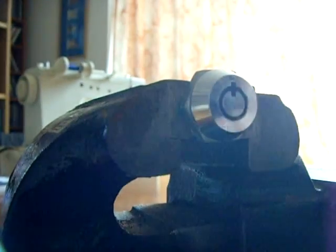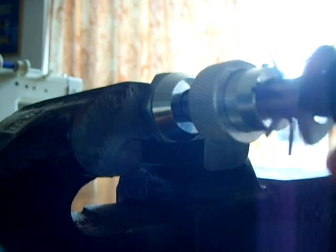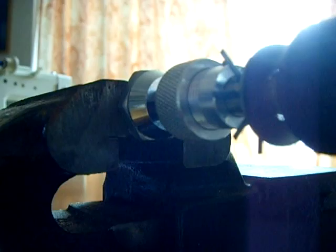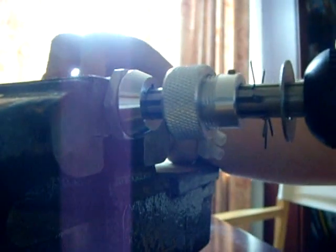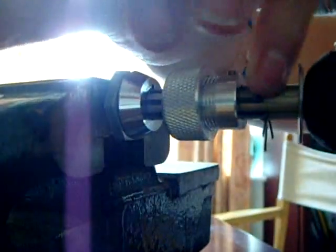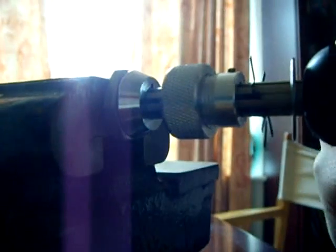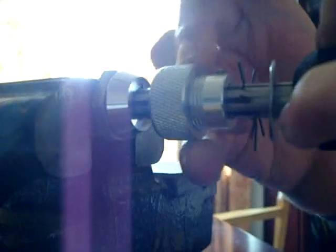So I'm basically going to just, with the pick prongs flushed, put that in there. Now, if I try to turn the lock, it won't turn. But as you can see, the prongs, for this next bit, I'm pushing in against the pins. So now you just push each of the pins in as far as it wants to go, which will be at different depths depending on how the pin is cut. And I've nearly got that there, and then you can tighten it off a bit more.